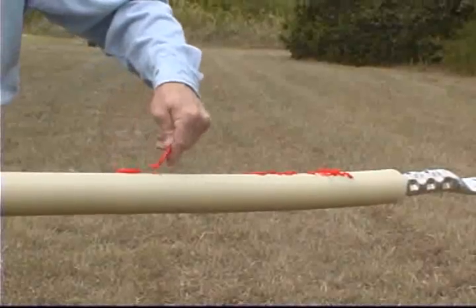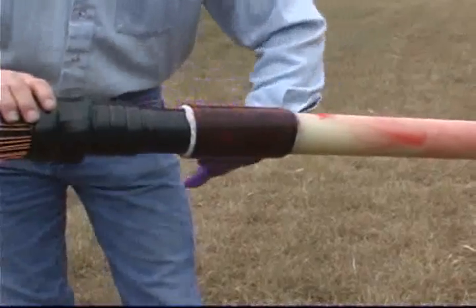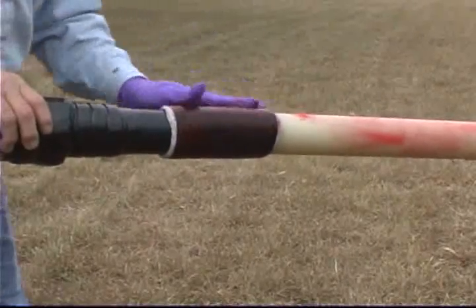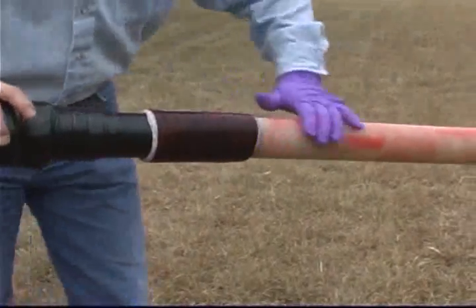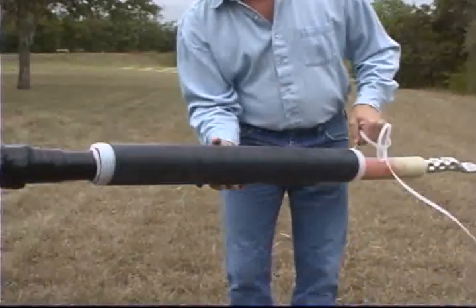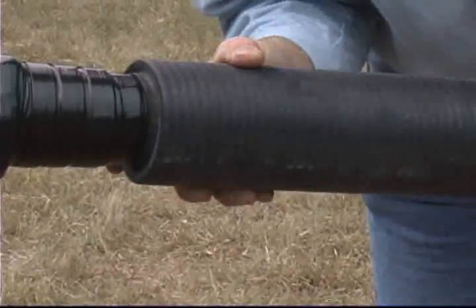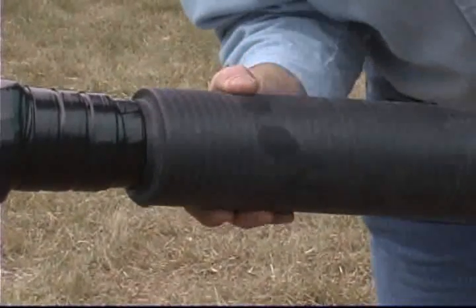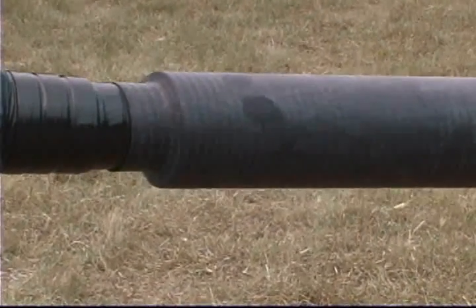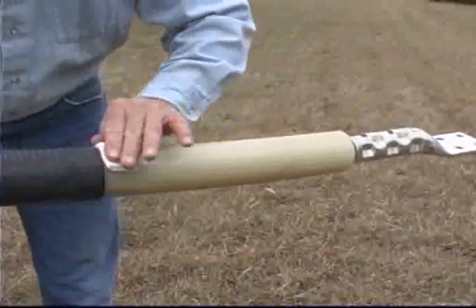Using two tubes of P55R red compound, coat the cable insulation starting five inches from the end of the insulation and going over the vinyl-covered mastic. Install the stress control assembly tube by sliding it over the cable. Make sure that the loose core end faces the lug. Align the tube, not the core end, at the edge of the metallic shielding and remove the core by unwinding it in a counterclockwise direction. Clean the exposed cable insulation.